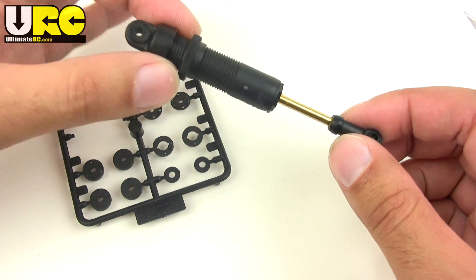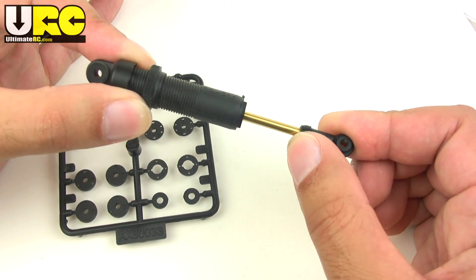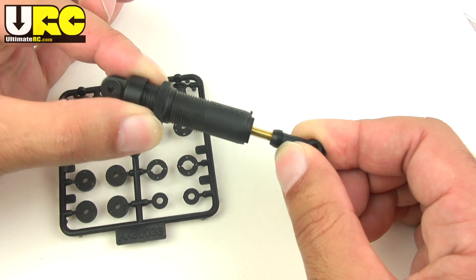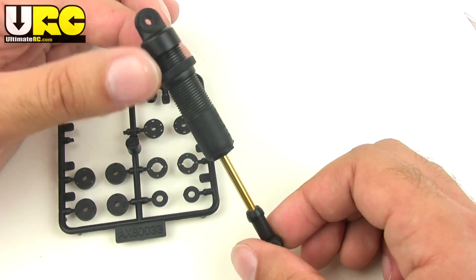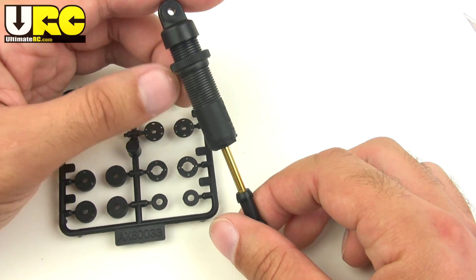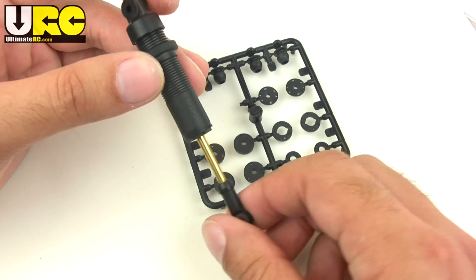They had a lot of stiction in them. Stiction — and it actually is a word that a lot of people use — refers to an event of friction that occurs momentarily where it'll feel like it's actually getting stuck, then it'll free up as you push in, and then it'll feel like it gets stuck again, ending up with that sort of jerky motion as you try to apply a constant force in or out. I chalked that up to poor construction, poor choice of materials, especially the body itself being too close in texture to the compound used for the pistons, so it was actually just chemically sticking to each other.